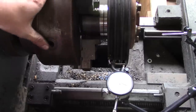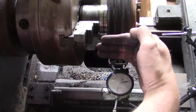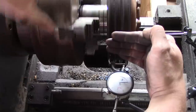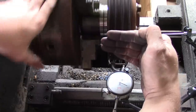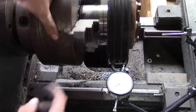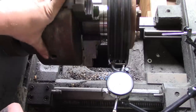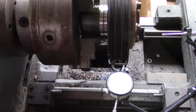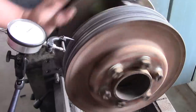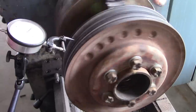This is the crankshaft pulley. I've got it chucked up — just chucked up that stub in my engine lathe and I'm measuring the runout. It's pretty bad — something like 60, maybe 70 thousandths total runout. It's got a spot right there where it just goes way off the chart. So I'm going to do a little hammering and see how it comes out. I think that's about as good as we're going to get. I'm down to about 15 thousandths total runout, maybe a little less than that. It's pretty decent.